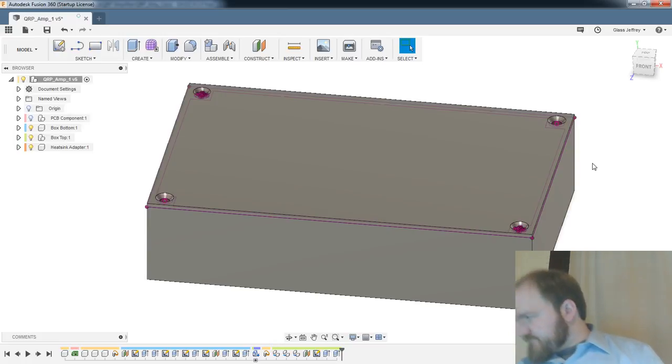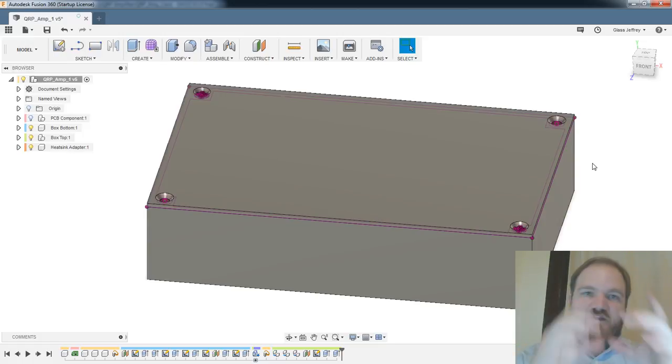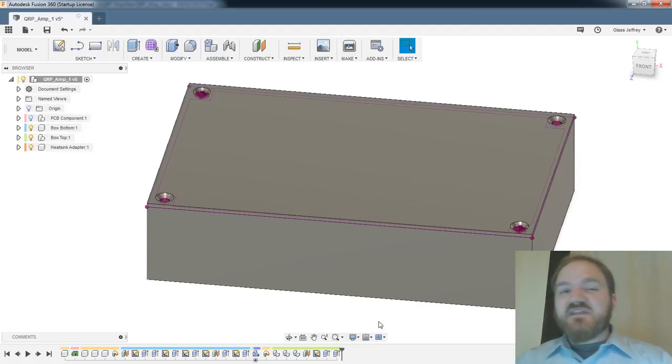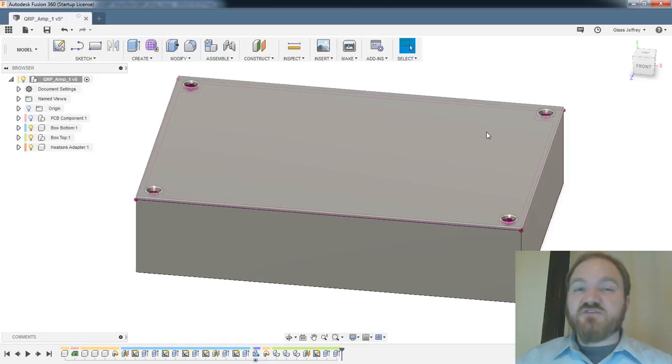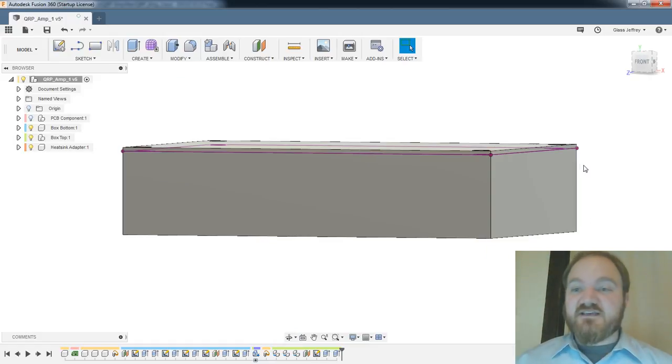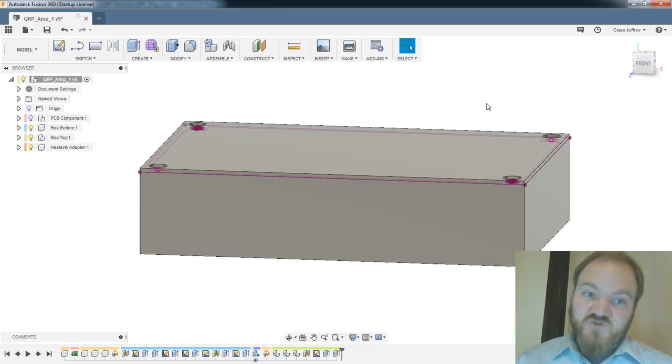I have been trying to get it working with the little nano clones, but the network shield that you can mostly get for those Arduino nanos, the super slim ones, has a different Wi-Fi chip. It has a different networking library. I don't think it's out of the realm of possibility to just use that one. But then you would have a thing the size of a pack of Tic Tacs that spoke ACN, which would be cool.